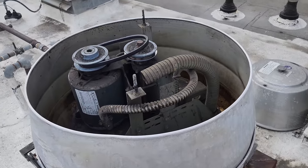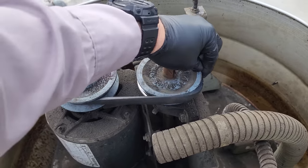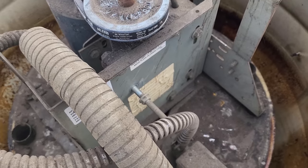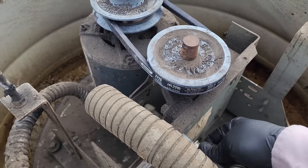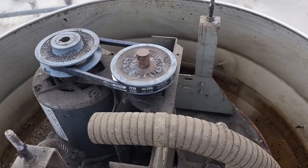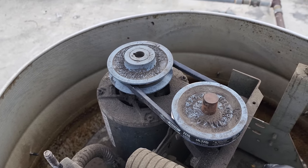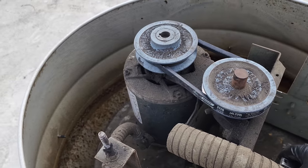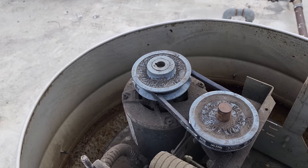I'm not going to say I'm perfect and never roll a belt on an exhaust fan. Rolling a belt on is when you just stretch it around the pulleys and roll it on — but it's always best if you don't. In this situation, I loosened up the motor mount, which takes the tension off, then I put the belt on and tighten it. That's the correct way. The other way risks stretching out the belt and damaging motor bearings by over-tightening. So you should always loosen the set screws, then tension it, then check your tension.